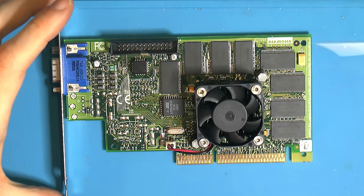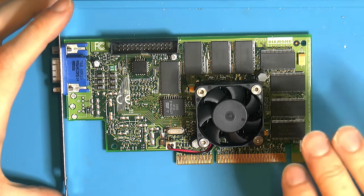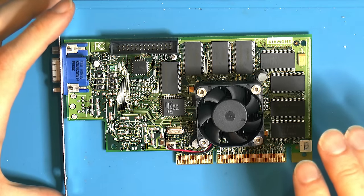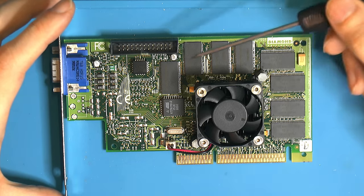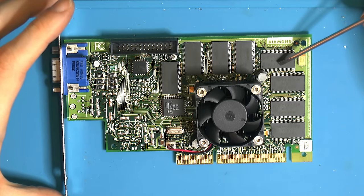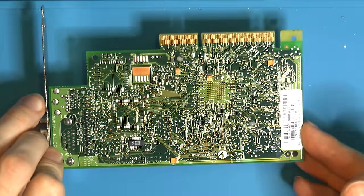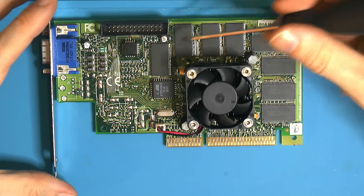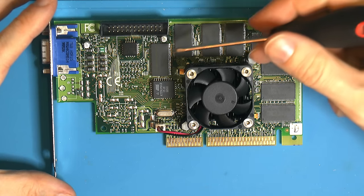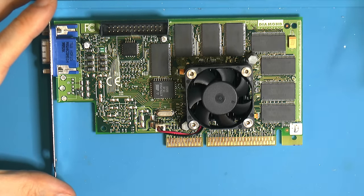I took some donor RAM from a Voodoo Banshee, because Voodoo Banshee, Voodoo 3, TNT, TNT2, probably the Matrox G200 and cards like that, they tend to use the same type of RAM or even the same brand. I have a PDF for one of these types, ranging, according to the PDF, from a clock frequency of 66 MHz up to 200. That's a pretty wide span for the same type of RAM. So they were used on a couple of generations there, from 98 to 99, it seems. The RAM at this era is still pretty dumb, so it's not like modern cards where you might have to flash a specific BIOS to your card for a specific set of RAM chips.